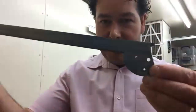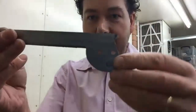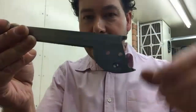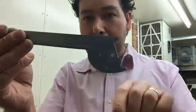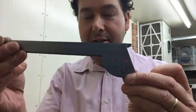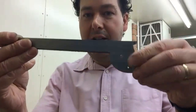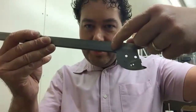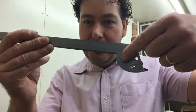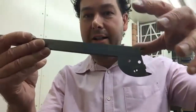Now this is a carbon steel one that is exactly the same. You can see it's shaped there. And then you can see at the back here, there's this slide. And again, the blade is assembled in and it's pinned at the front. It's pinned when the slide's closed, and then there's a screw in the back, which pulls this and pulls the blade in tension. Now, the blade itself is cut round in this shape and it misses these bolt holes. So there's no interference between these bolts and the blade. So like I say, the handle isn't actually doing anything.